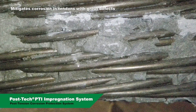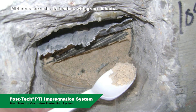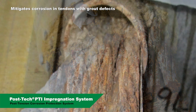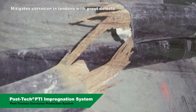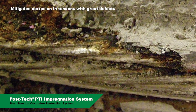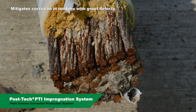The long-term durability of grouted post-tension tendons is dependent upon the protective characteristics of the grout. Unfortunately, in some cases, the tendon durability can be compromised by grout problems such as bleed water voids, voids due to improper grouting, segregated grout, chloride contaminated grout, soft putty grout, or dissimilar grout materials. Insufficient grout protection can allow the post-tension strands to corrode and prematurely fail.